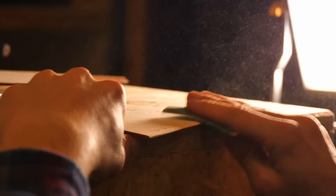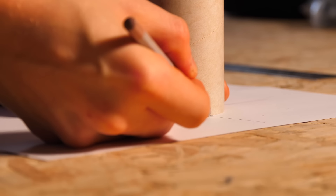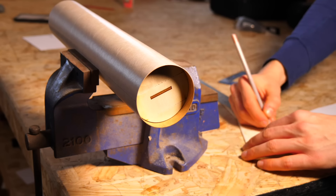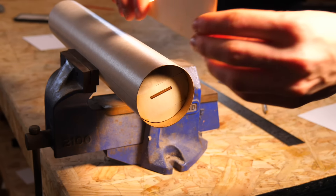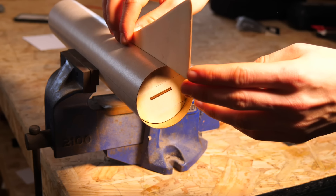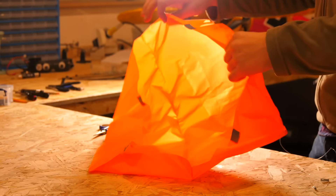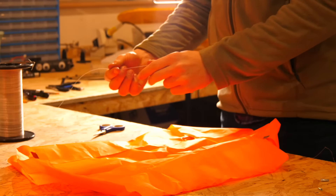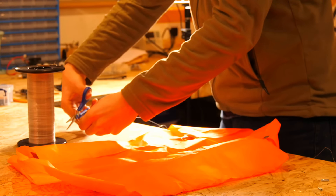Fins were shaped to have blade-like edges to slice through the air, which will pass over this rocket at speeds of around 250 miles an hour when the rocket is at its maximum velocity. The fins need to be dead straight to avoid rapid unscheduled disassembly. DIY parachutes were made using nylon, but I think I will be upgrading these as they're a pain to make and quite terrible when compared to commercially available model rocket gear.